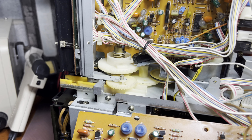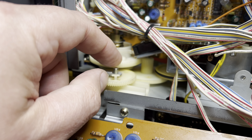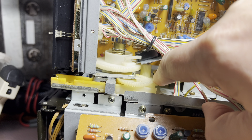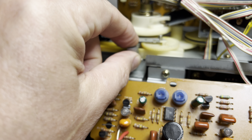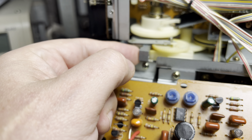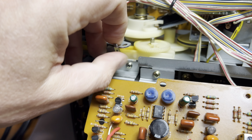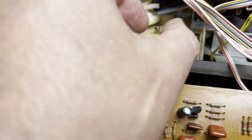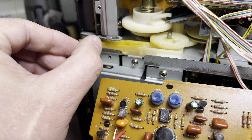The motor — here this gear is fully tied with the main gear so there is no slip. If I go to the fully inside position... switch it, and it's the far right position this door arm can go. There is a support in the plastic which won't let it go farther back. You can see it cannot go behind this position — that's the farthest one, even if the gear itself can.